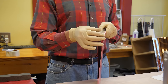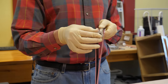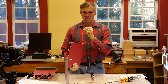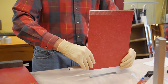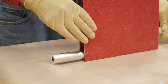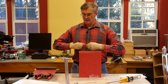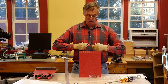It doesn't work very well. A better way is to actually insert the spacer a little below the ends of the fiberglass panels. The way to make sure this happens very uniformly is to take a spacer — like this three millimeter metal machining spacer — place it like this, and use that to push the rod up a given amount of distance. Then I take a five-minute, quick, not very structural epoxy, and what we're going to do is tack the rod in place for the machining I'm going to do afterward.